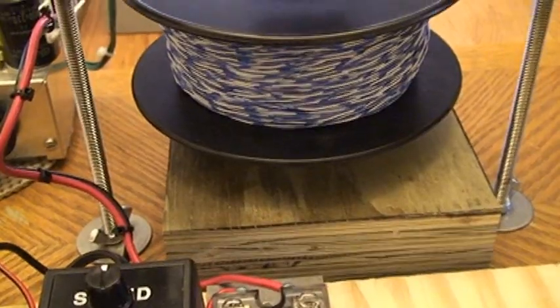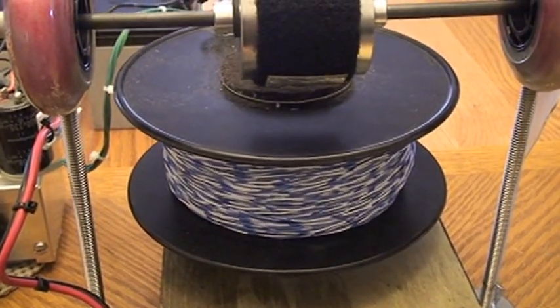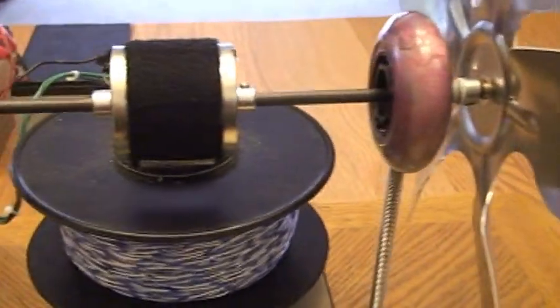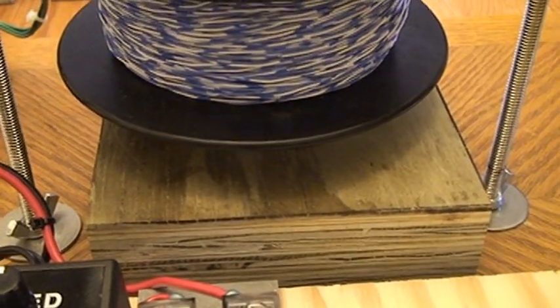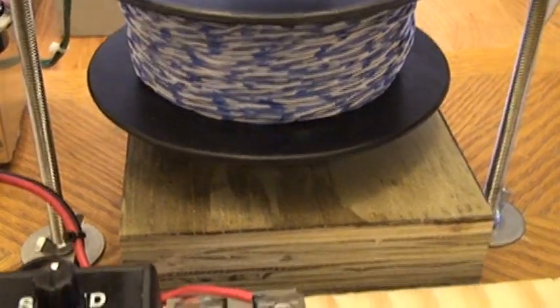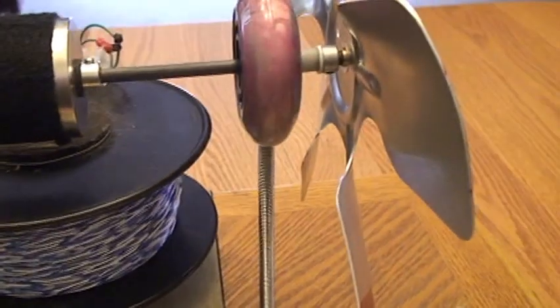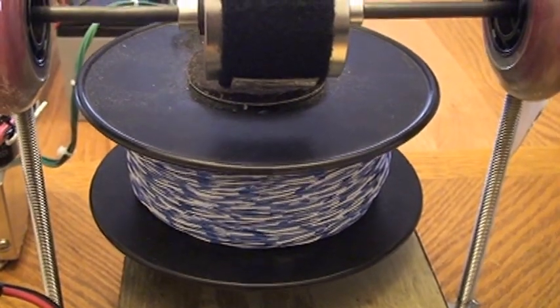When you make this, if you ever make it, you're going to find that that coil has a sweet spot to be in for any demand made on it. In this case, I'm running a 10-inch fan motor with a fan blade — 10-inch, five blades. That's going to be pushing some air. I got risers under it, a big wood riser, and between the big wood riser and the bottom of the coil, it's coasters — you can make them out of plastic, phenolic, ceramic. I have ceramic ones there to raise that thing up. The coil has to be a little closer to the magnet.